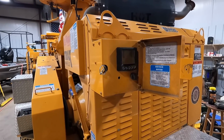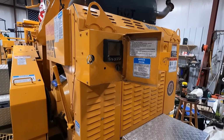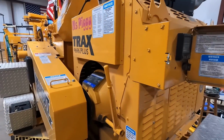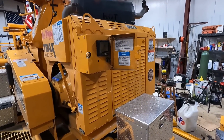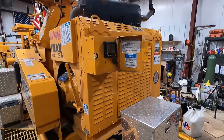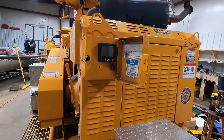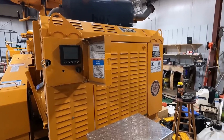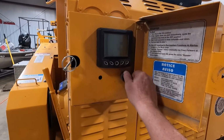It will run, and all of a sudden you'll hear it kind of start fluttering, like it's trying to run out of gas, but it's got plenty of gas in it. And then if you idle it down and you bump it back up, it'll catch itself, and say you get it up at 1200 RPMs, it'll stay running and it's fine. But if you idle it all down and you don't bump it back up a little bit, it'll kind of start spitting and sputter until it completely kills itself. And then you wait a little bit and it'll crank up and it'll run.